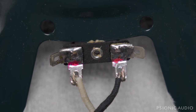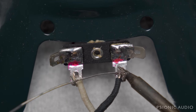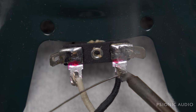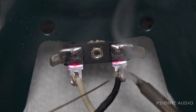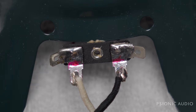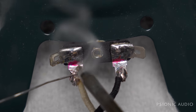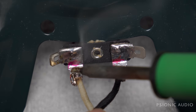Now it's time to solder that wire to the new speaker. You can see that the wire is bent over and crimped upon itself mechanically before solder is added — I'm not using solder as glue. This wire is pre-tinned, but I'm bringing the iron to the components and then adding the solder to that. The paper towel is just to keep solder spatter from hitting the speaker cone.